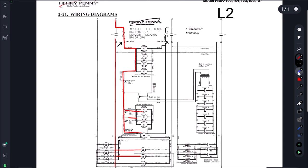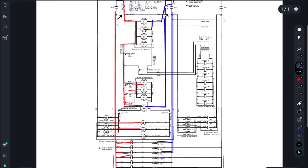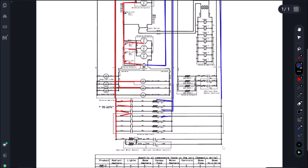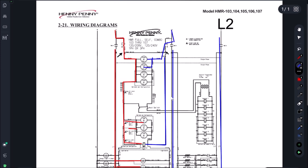Our L2 side - we're coming through here, same thing - we're going to hit up our canopy fans. So this whole section could have a short in it, and then our contactor coil, and then we come through here and we're going straight into these elements. Our L2 is also branching off down to our water bath elements and straight into all of our base heaters.